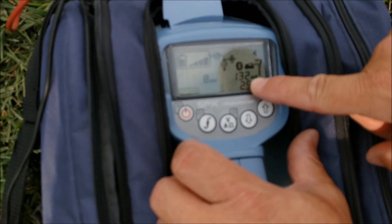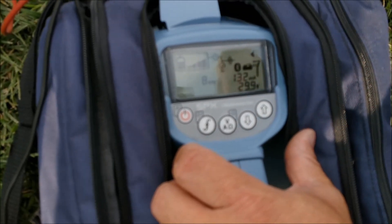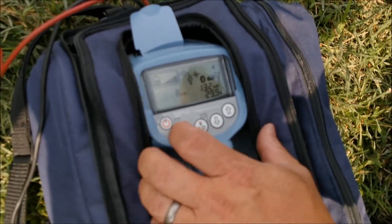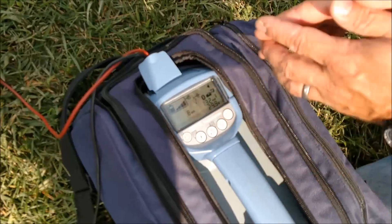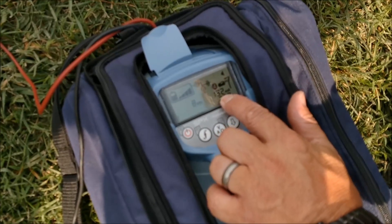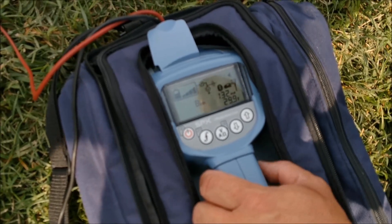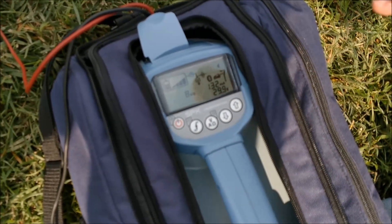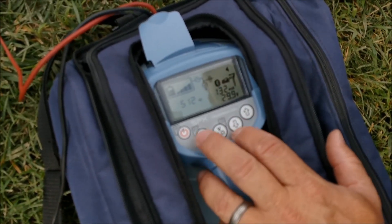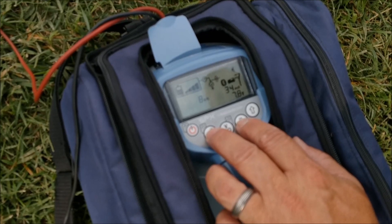All these milliamps are doing is going down that wire and returning back through the ground to get to the ground rod, wanting to complete the circuit — going the path of least resistance. When you go higher in your frequency, those milliamps kind of go all over the place to try to complete that circuit. When you stay low on your frequencies, more of those milliamps travel the direction you want. Hooking up in the proper spot is important because the lower frequencies will stay on that path and won't bleed off. On this wire, 512 hertz is probably best, but if the other end of the wire is not connected, 8 kilohertz is going to give you more milliamps.